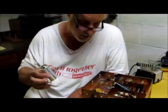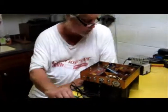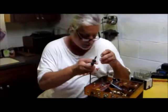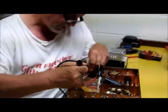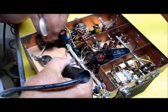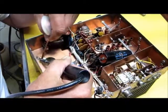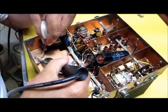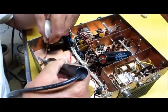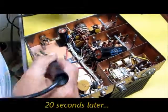I do not believe in reforming these capacitors or trying to make them good again. I just rather buy new, and that's it — you buy new, you get new. Now I'm going to clear up some of this solder using solder wick and my heavy-duty Heathkit iron. Let's see what we can do. She's wicking up — not like I'd like it to, but it's working. A little hot there. Okay, we got enough wicked up.